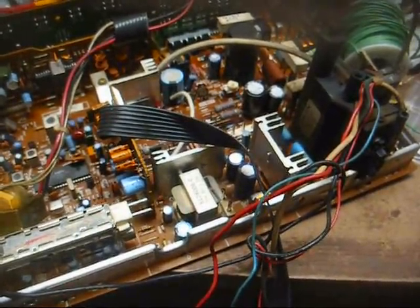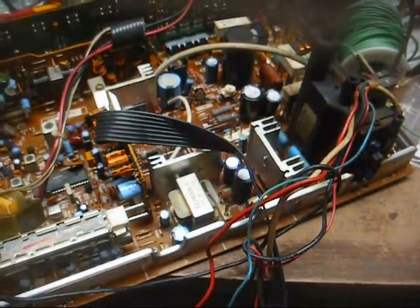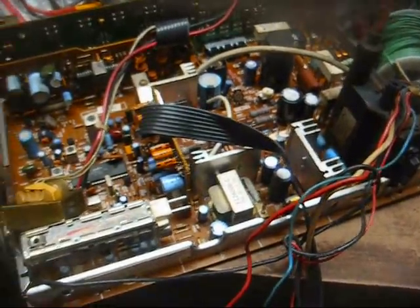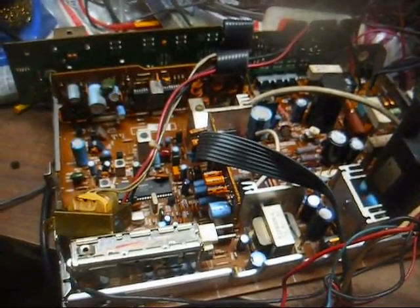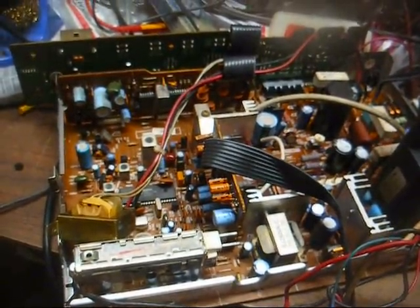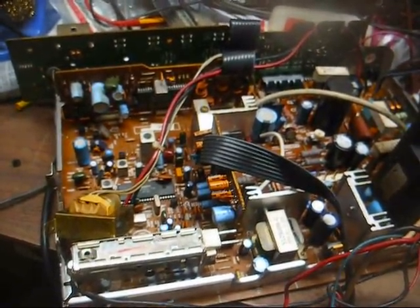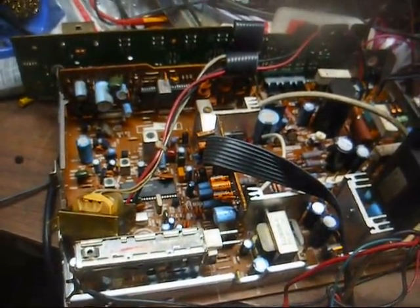Except for some rare occasions. And of course there are those Mitsubishi TVs made from the mid 80s through the early 90s that the capacitors like to spooge all over the place and make a big mess. Now those you might have to recap, as well as clean up the mess, and jump out any foil traces that the electrolyte ate through.